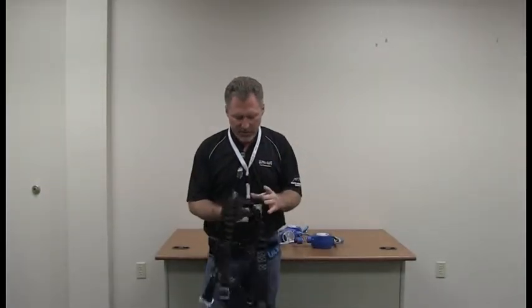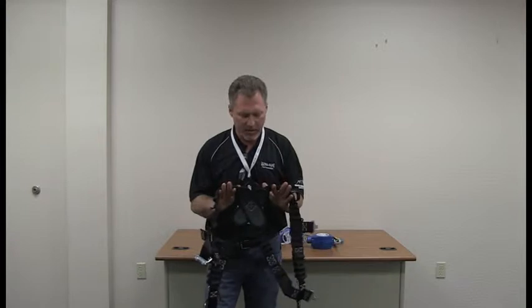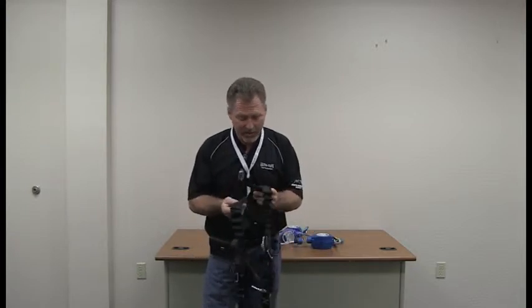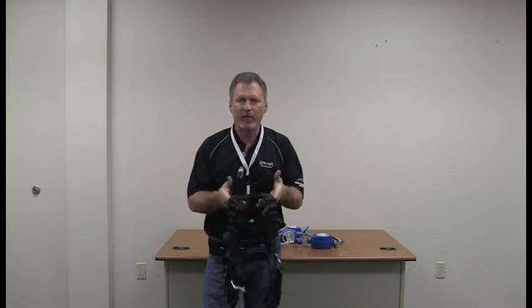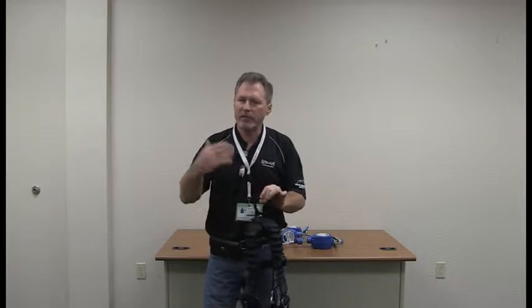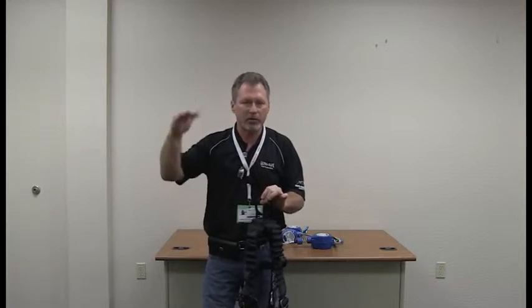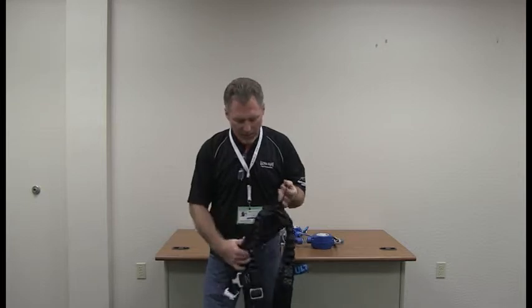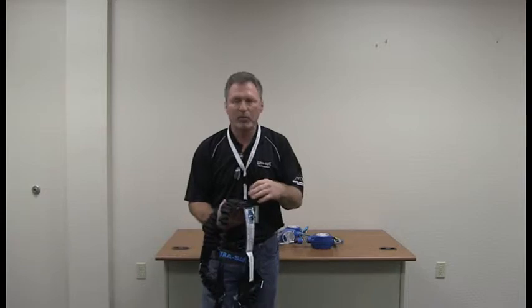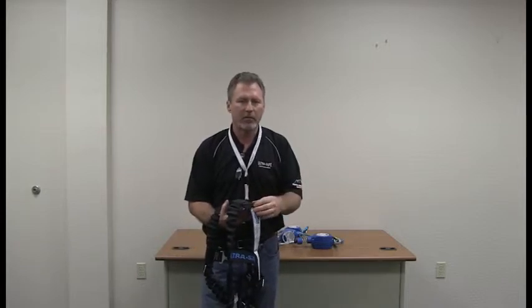I'm constantly also asked if these have a shelf life or a service life. And there is an ANSI reg that was written by a manufacturer, probably to sell more harnesses, that they have a 5-year shelf life or a service life. But you have to refer to the manufacturer's recommendations first, which would override that. Most manufacturers will say that you must inspect before use. They would like to have a minimum of an annual inspection, written by a competent person, that they be in proper working order. And as far as the lifespan, it could be forever.